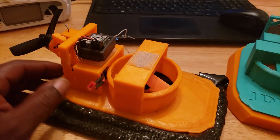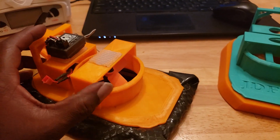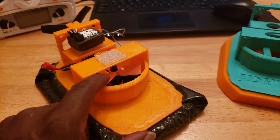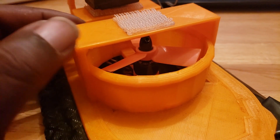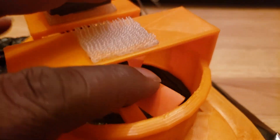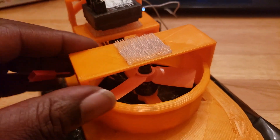This is basically made of spare parts. Most of you guys fly mini quads or used to, so you're sure to have some motors laying around. The lift motor here is a 1306 3100kv motor. The actual prop in there was an HQ 5 by 4.5 inch prop, but it won't fit as-is, so I had to cut it down — just kept rotating the prop and cutting until it wouldn't rub the walls.